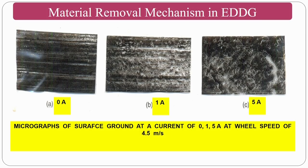Looking at surface morphology: at 0 amperes (pure grinding), only grinding marks are visible with a straight-line surface texture (lay). At high current, craters are present along with scratch marks — this is the combination of material removal by melting/evaporation plus shearing by abrasive marks. Material removal is therefore higher in the high-current condition compared to the pure grinding condition.